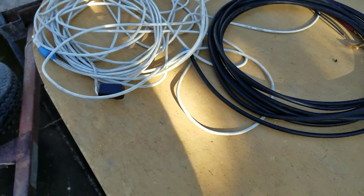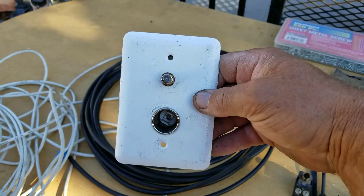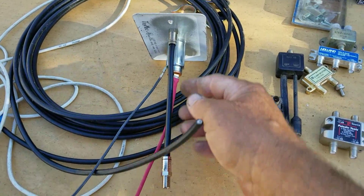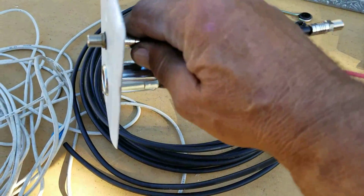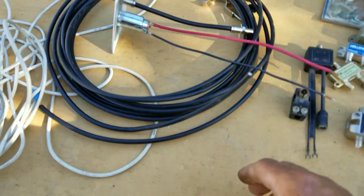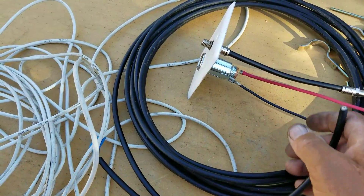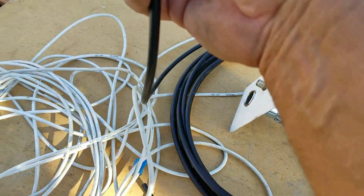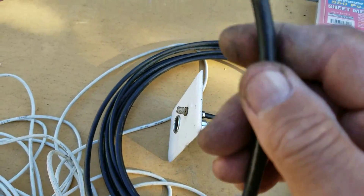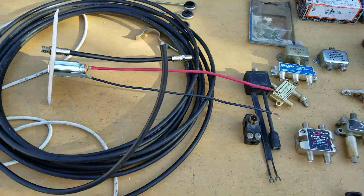This is a little item I made for my shack out in the desert, because I'm going to be running a 12-volt TV off of it — this will connect to the solar. For right now, for testing, I made this little patch cable with two male connectors on it. One male goes through here so I can connect my TV with a short patch cord. When I get out there I'll be running a fresh wire in — I'll put a new male connector on and go straight in. I could also just go straight to the TV with a female connector and hook that directly.